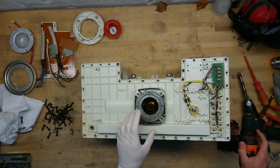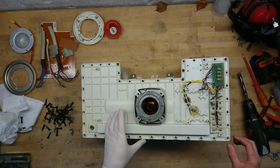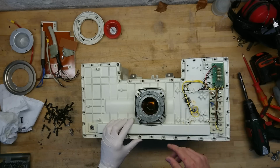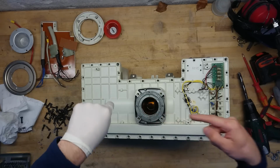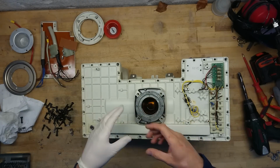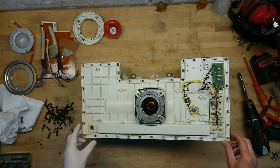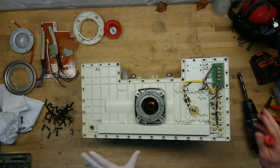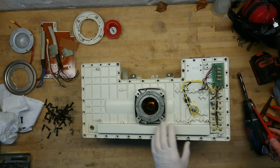So I actually think that, from the size of this and the energy level, this is one of the X-ray tubes with a rotating plate. Where the beam comes out, it actually hits a rotating plate, so that it does not burn a hole in the plate. As it rotates, it will have a 360 degrees full plate that keeps changing, so it can also cool off. And also, yeah, it'll last longer. If it's a very used unit, we should be able to see a track on this rotating plate.